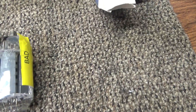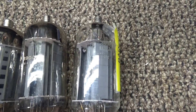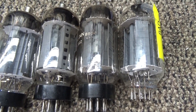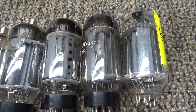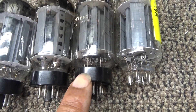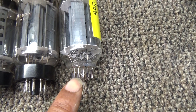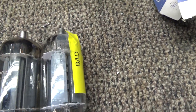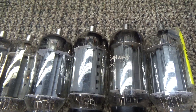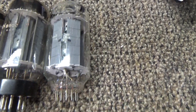Last, there is a 12-pin 40-watt tube — the only one made that way — not a 6LW6, not an 8950: it's the big bad M2057. What happened is that during the last version of tube amplifiers, when TV sets weren't using tubes anymore, GE had a lot of 6LW6 and 8908 tubes sitting around. Mako talked to them and said, 'Take this and put it in a 12-pin like we use in our amplifiers.' So GE did that and came out with the M2057 — a 12-pin tube built on the 6LW6 platform, with the same great big plate, same big bulb, 40 watts, just in a 12-pin package.